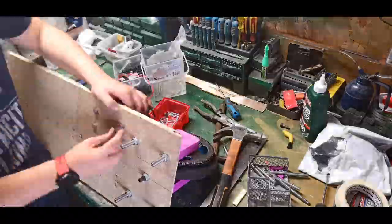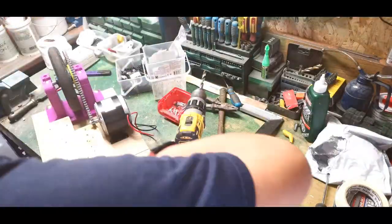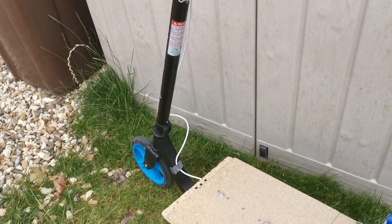The mount for the wheel, which you can see here, is 3D printed. It's actually quite strong — it holds the bearings and it's set with about 40% infill, which is why it actually works. It took quite a few hours to print, but without further ado, on to some tests.